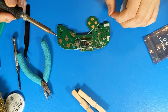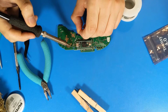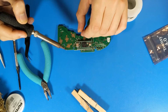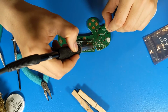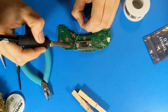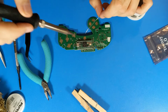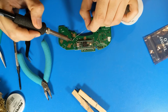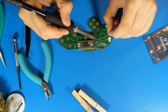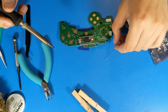At this point, once one bottom leg is in, I slide the sliders back to the top and begin working on the actual electrical contacts. To reduce the heat load, I prefer alternating between the two potentiometers. I'll also go back and solder on this leg. Double check that they are laying flat. All four legs are firmly against the board. And then finish it off.